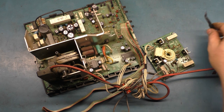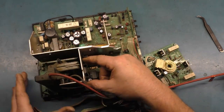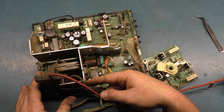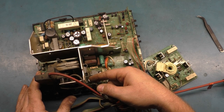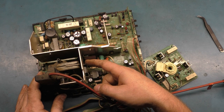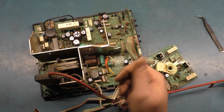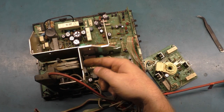So on the K7400, 7500, U2000, U5000, there are, right here along the heat sink, there's the HOT, which this one conveniently has the HOT on this heat sink as well. There's the HOT, a control diode, and the transistor that's responsible for controlling your width, the ability to control your horizontal size. The transistor's mounted right here.